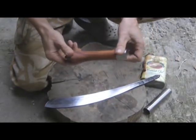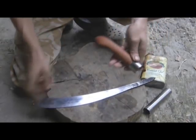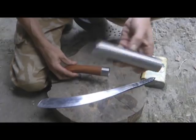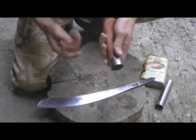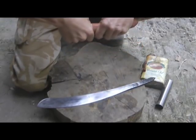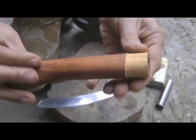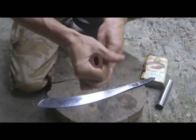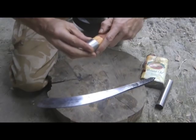With the handle, originally I wasn't going to put a bolster on, but I decided I probably needed it because this is quite a long parang. What I used was a piece I think came from a vacuum cleaner, but quite often people just use copper pipe. You want to get a nice snug fit on this — it takes a little bit of time to get it right. What the bolster does is support the handle and hopefully stop it from splitting.